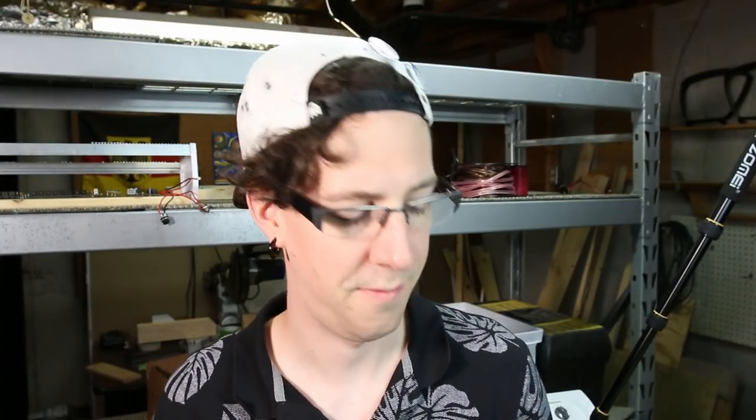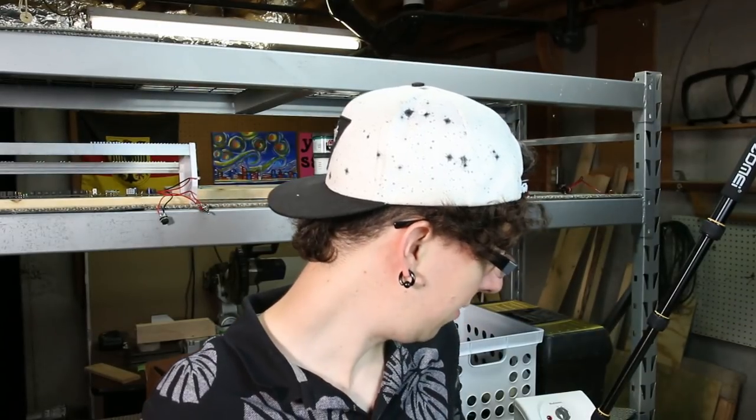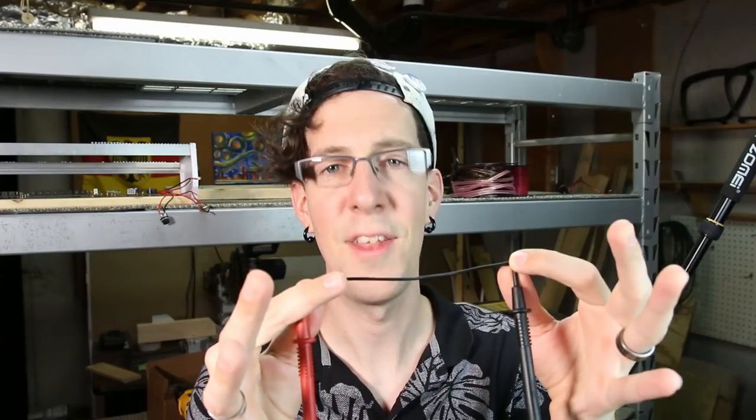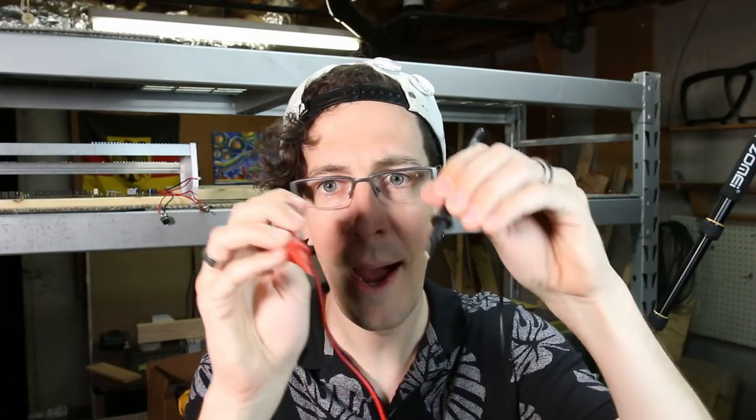Here's a note about how to troubleshoot this stuff. This is a multimeter and I've been using it for continuity — meaning, is this connection solid? If I turn it to this setting, it checks whether a small pulse of electricity can pass from point to point. Hear that noise? That's what happens when you connect the tips — meaning there's a complete circuit. The same thing can be done with any piece of metal, like a wire. You connect one end to the other and that's continuity — a complete circuit that sets off the alarm. When testing a circuit you go one by one, testing individual joints to determine whether a connection is made. This process was exhausting but necessary.